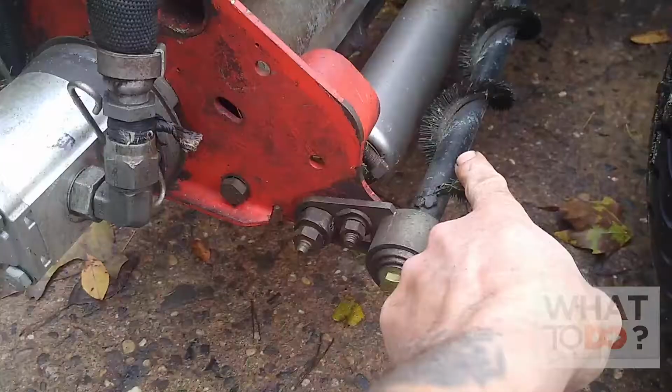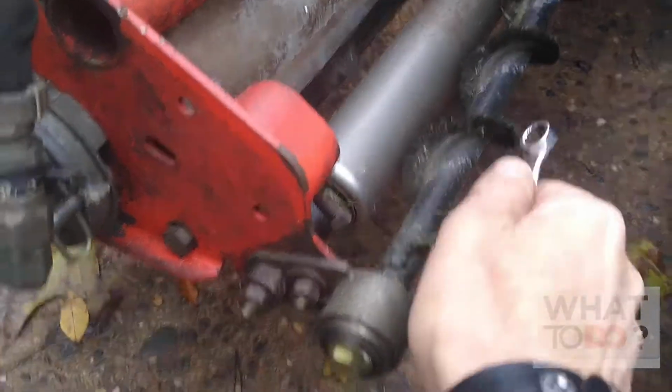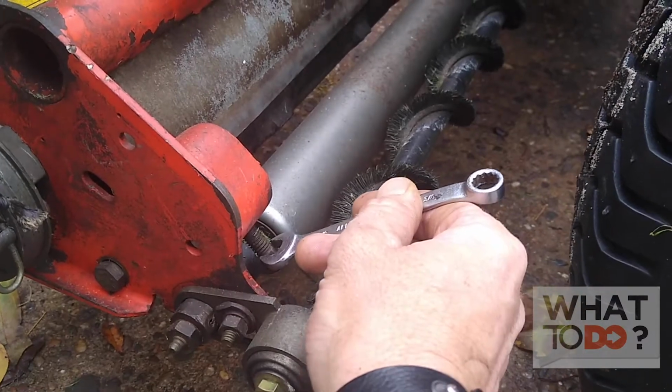That reel is not making any contact at all. You can leave the machine on and do it that way until you hear the contact. So you'll hear it when you're adjusting because the reel is spinning. Or you can adjust it while it's off and then turn the machine on and see if it's too tight or too loose still or whatever. I normally leave the reel on, but it's very unsafe because you have this spinning in the back, and that's spinning so close to this bolt. Not that this would cut you, but it is a moving part and you should not have your hands there.